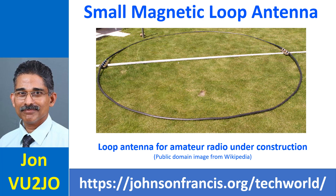Small magnetic loop antennas can be used both indoors and outdoors. They are cheap, easy to build antennas which have been used for even DX contacts with an indoor antenna running 50W for CW, PSK, JT65 and FT8 modes on 10-40m according to K5IJB.